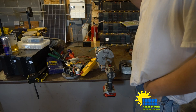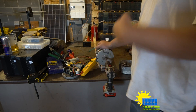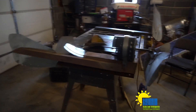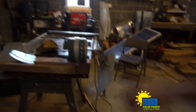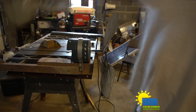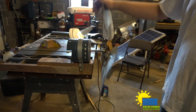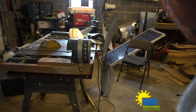Modern DIY Off Grid got me excited watching his videos and I wanted to check out what the wind power hype is. I did make another one of these — here it is. This one's model 1.0. It doesn't have the angles on the wood, but on the back it's got the tail fin, and it's got a different type of motor. I believe this three-blade fan is better because it'll start easier. The four-blade one I have puts out more voltage on this specific motor. So what I might do is swap the blades between the two units and try again.